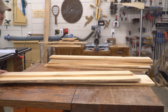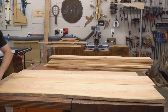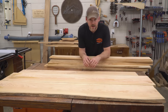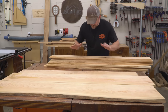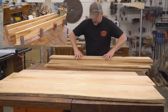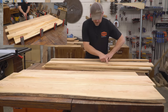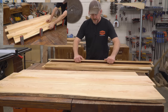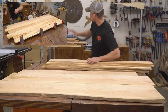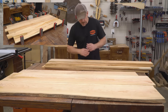This is enough to make the main work surface of this desk, and I left a live edge on because I'm hoping that when I put it together I will be able to have a live edge front on it. Now below this is just going to be the bottom — it might as well be made out of cardboard because you'll never see it. So it doesn't really matter that this is thinner or less desirable. I just have to combine all of this, ripping out some stuff that's still not flat, cut out cracks and imperfections, and combine these into another 24-inch wide panel. Then I've got enough remaining material to do the drawers, the vertical components, all that stuff.